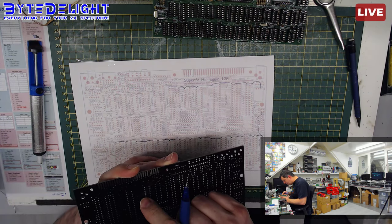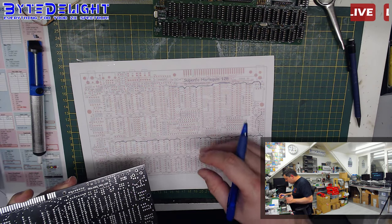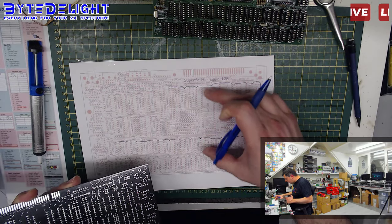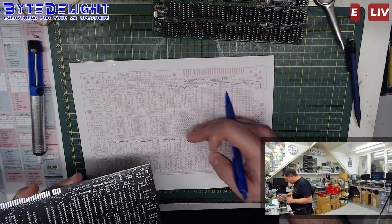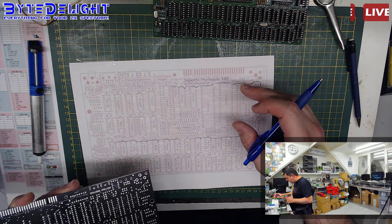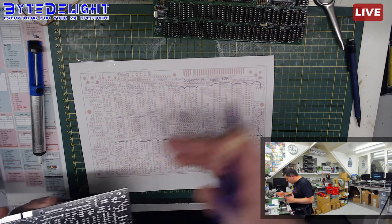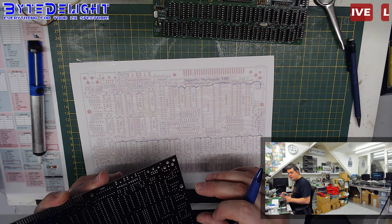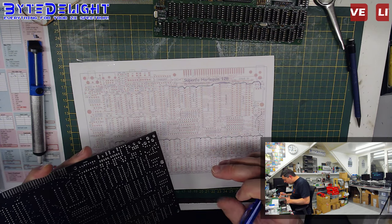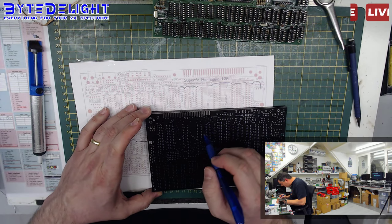And I wonder which that could be, because I want to cut one of the lines so I can create two nets instead of one and check where the fault is. So if I cut away part of the 5 volt, and the board is getting 5 volts again, then I know it's on that side of the board, for example. So that's to rule out pieces of the board. That's what I want to find out. So I want to check now where the 5 volt goes down.